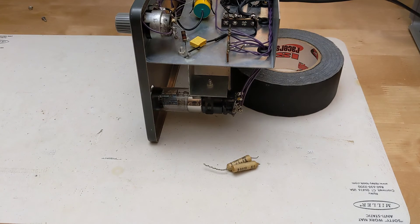One of the other replaced paper caps was a precision 0.02 microfarad. Heathkit provided this as a pair of 0.01 microfarad caps in parallel, presumably selected at the factory to be close to 0.02 microfarad. Otherwise, the tolerance of these caps would normally be at least plus or minus 20%, limiting the accuracy of the tester. I measured the values of a number of 0.02 microfarad caps I had and selected one that was very close in value.